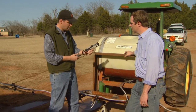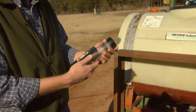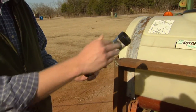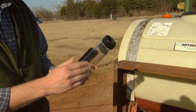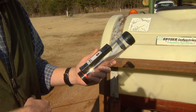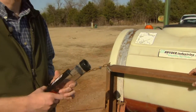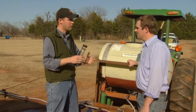Another way to do it is use this little spot-on sprayer calibrator. Basically you just hold this underneath the nozzle tip. It'll fill with water and there's little electrodes in there that sense as the water's filling, and then it'll tell you right on the screen your gallons per minute. This is a little simpler way — kind of an expensive tool, but it does make it a little bit easier than doing all the calculations, and really fast.